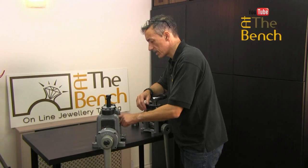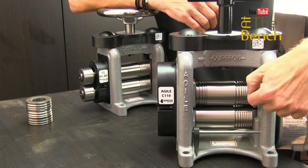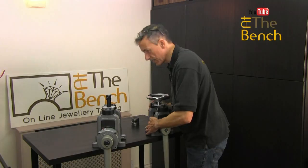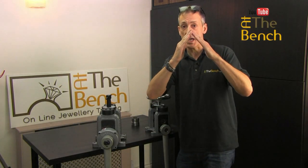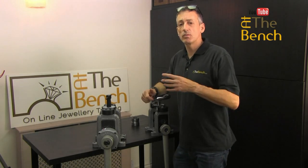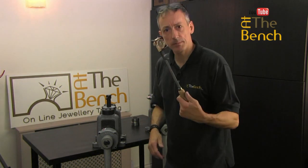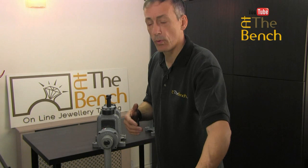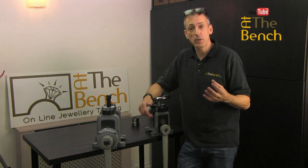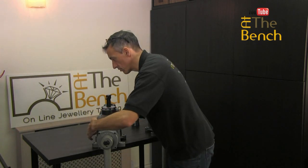Durston also produces another mill without D-sections on the main groove — I'll show you that one in a second as it's downstairs. You've also noticed we've got these little grooves on the other side here, and on this little one here as well. These are literally V-grooves — grooves that are V-section — and you have the same ones on the top as on the bottom. That enables you to roll down square wire: you'd make ingots, pour them into a shallow groove or a charcoal block, make them into a little rectangular ingot, and then use these V-grooves to produce wire.